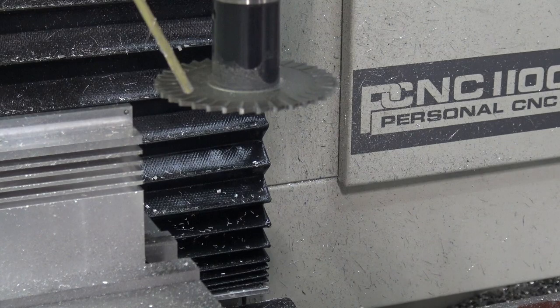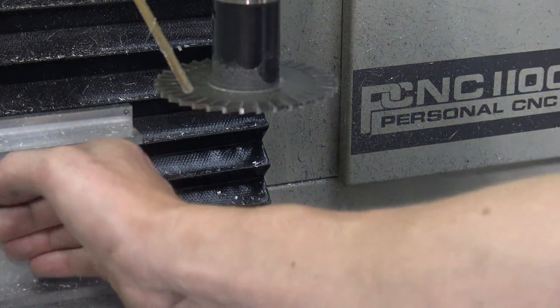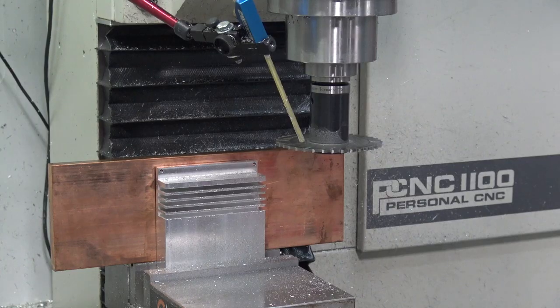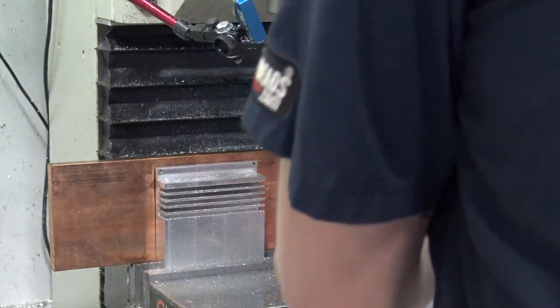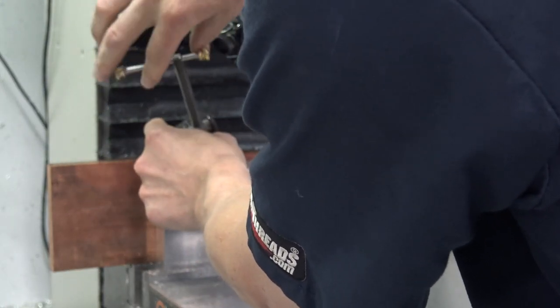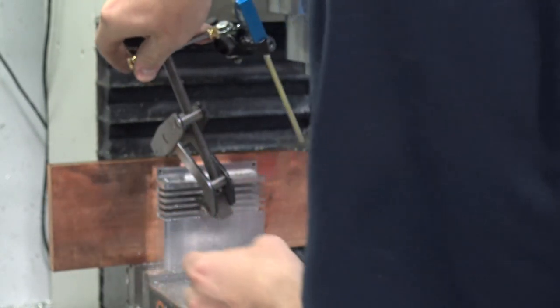I've got an idea why it's chip welding. The part's hot, like really hot, which I knew. That's just gonna happen. When we were doing our test cut pieces, they're over on my bench, the part gets hot. So let's let it cool for a minute. Come back. We're making a heat sink. Hell, let's try using a heat sink. Big piece of copper. It actually really should, in theory, pull some of that heat away pretty quickly.